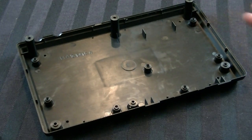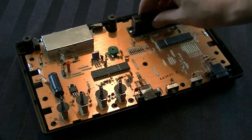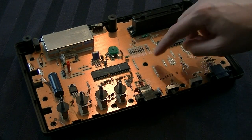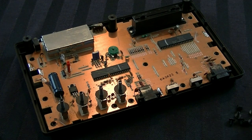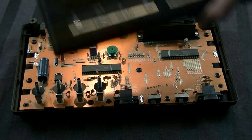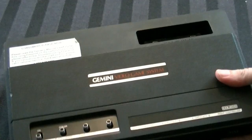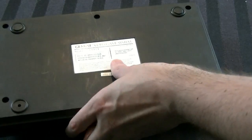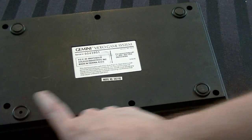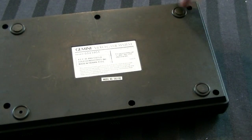The plastic is now completely dry, so it's time to put the console back together. All we're going to do is take the motherboard and sit it back into place. There are seven screw points, so go ahead and put all seven of those back in. Then take our lid and sit that back in — and believe it or not, the console's basically back together. Flip it over and put the outer screws in: three big ones on the front and three smaller screws on the back.